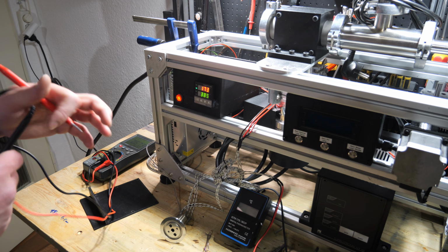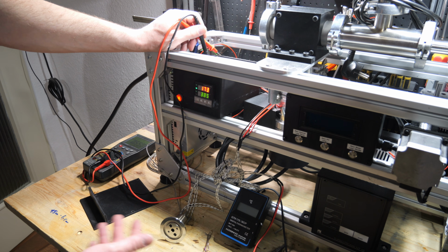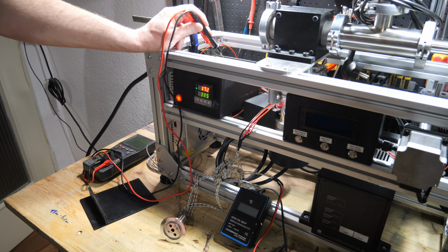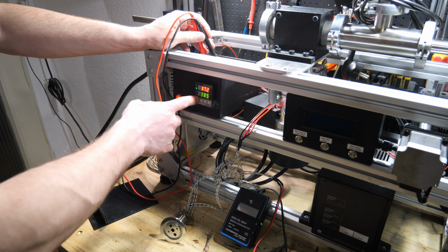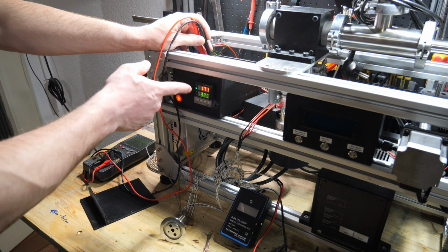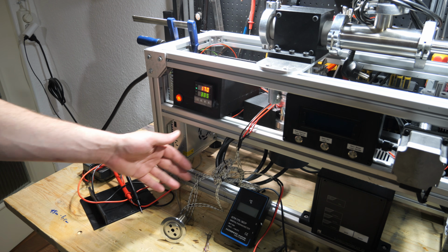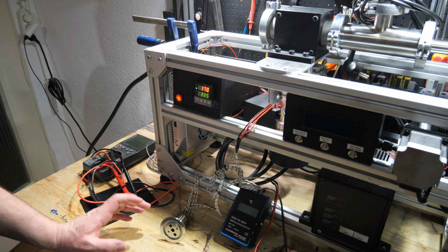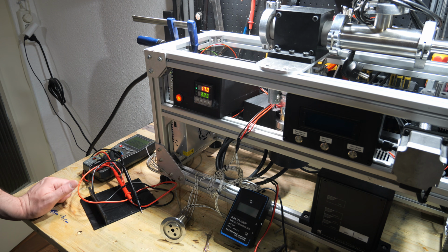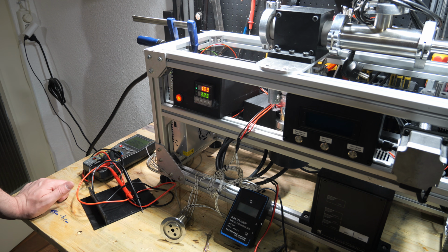It doesn't even open, and before it was closed for some time, so my atomic beam furnace heated to I think 250 degrees Celsius, even though the PID controller should have shut off. And right now the relay doesn't work at all, so at least we know that the heating cartridges are powerful enough, or even way too powerful for the atomic beam furnace. I'm just going to have to order a new solid-state relay.